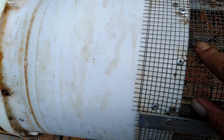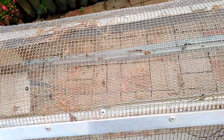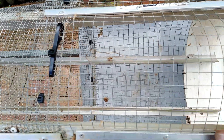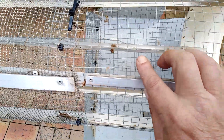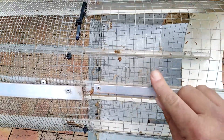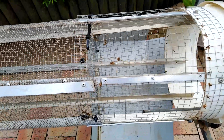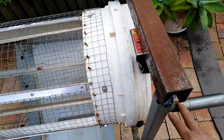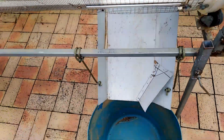I've used fine meshing — I think it's about 3 to 4 millimetre — as my main wire, then I go into a larger wire to let the actual stone out, and the very big stone will fall through. This section is going to be made a little bit bigger because I'm not happy with it — it's just chicken mesh or bird wire, but I need to make it slightly bigger because a few stones are getting through and you'll lose them if you're not keeping an eye on the back end.